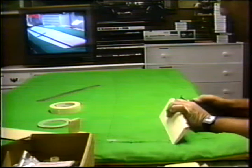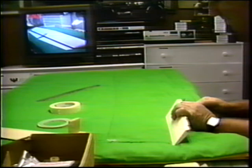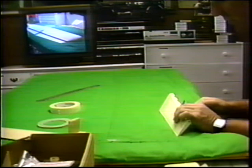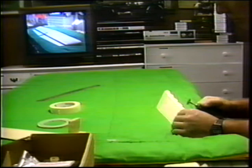Try to hold the Dremel tool steady on the table if you can. Don't go in all the way up to the shaft. Try to keep it 90 degrees to the table. Notice I have the pad on the table. It'll make for some real nice hinge pockets.